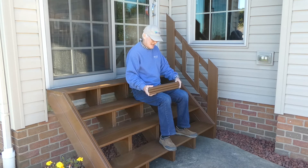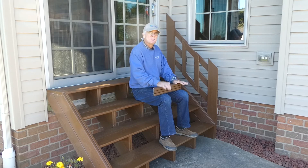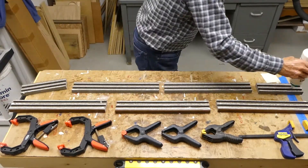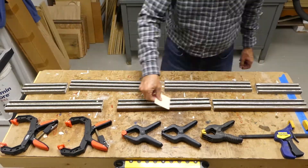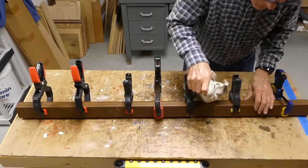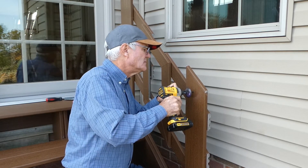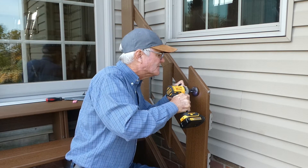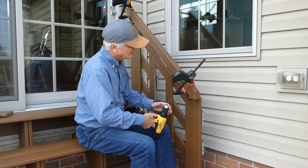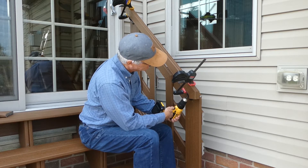You just need to add the actual railing itself — the handrail — in order to complete the project. I have some scraps left over and I'm going to see if I can cobble together a handrail that will match the steps from the pieces left over from the rest of the project. Each butt joint will be overlapped with a continuous piece on the other side. I'll glue all these pieces up to make one complete handrail. The next step is to add the hanger for the handrail. In succession, I will add the bottom hanger for the handrail, move up to the top step, hang the top hanger, then use some clamps to hold the handrail in place while I put in some screws from the underside to complete the installation.